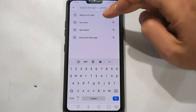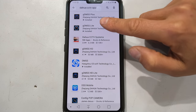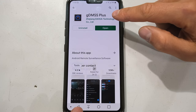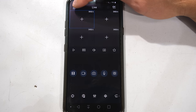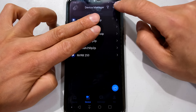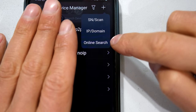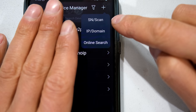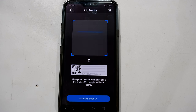I search for the Dahua app — you can see 'Dahua CCTV' app. Make sure you download the one from Dahua Technology Company Limited. I've already installed the gDMSS Lite — gDMSS Plus will also work. I go to the Add Device option, tap Home then Device. I already have some clients listed so I tap the plus to add a new one. It's asking me to use serial number, scan, IP/domain, or online search. I'm going to show the serial number or scan option. For port forwarding setup, check my other video in the Dahua playlist.